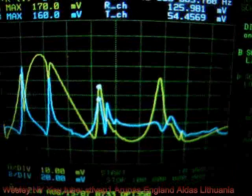We have the frequency of 9.888 megahertz. Now we switch to the Smith chart. So that would be format R plus JX. And now we switch the marker. Here is the data of this strange structure. At this frequency we have 73.4 whatever ohms on the primary impedance, 111 on the secondary impedance on the right hand side, 1.785 millihenry of the inductance between the windings, if I measure it properly.